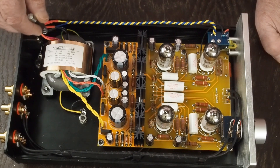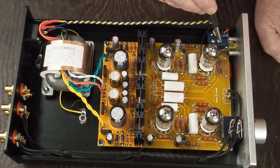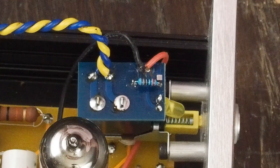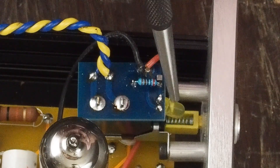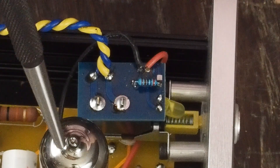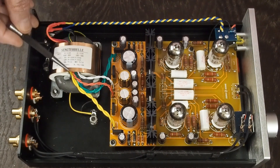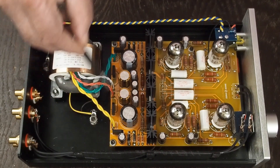The power switch came with a little circuit board. It has the two 120-volt connections, a holder for an LED with a dropping resistor, and two wires that go down to the six-volt heaters. I experimented with the value of the dropping resistor until I got the LED brightness I wanted — 2K ohms came out to a nice level.